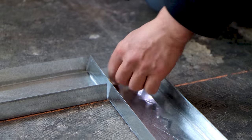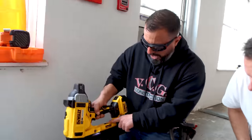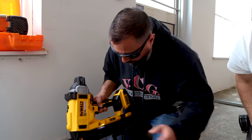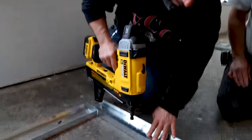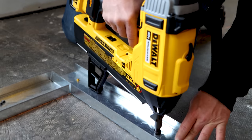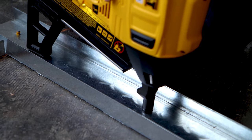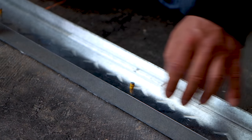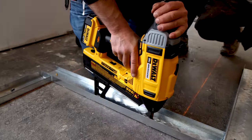You can see those pins are a little proud. This is very hard concrete. I mean, the pins are definitely holding, but we're going to set it up and see if we get a little bit more embedment into this old hard concrete. Ready? So you'll see we got a little tilting there, but plenty of embedment. Go again.